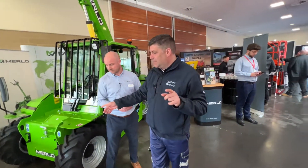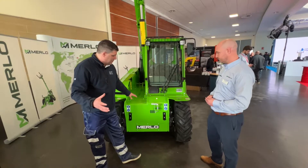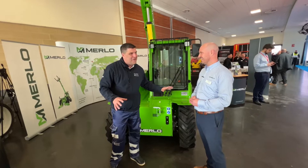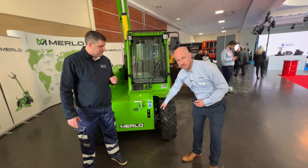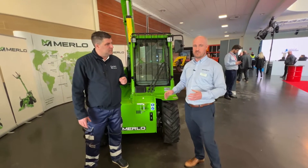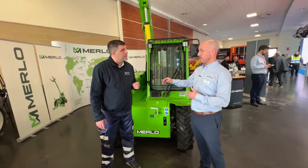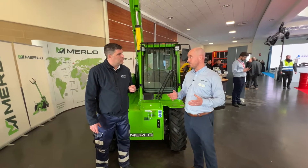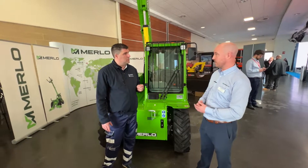As we walk around, we see again here with telehandlers, you're looking at moving around sites. But this is quite compact at the front. Watch the drivetrain here at the front. So the way it works, you can see down here, we've actually got two electric motors. The front axle is a fixed axle with the two motors there. And this machine is offered in a two-wheel drive version or a four-wheel drive version, which will give you an additional motor on the rear of the machine, which we can see a bit later on.